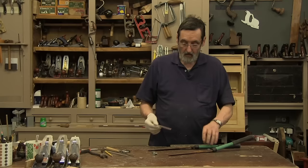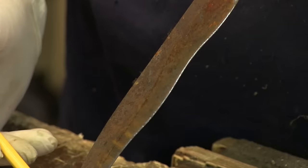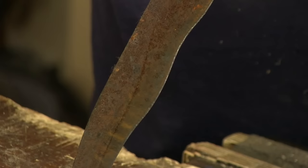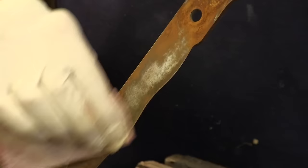You don't need very much to remove the rust — just some 250-grit sandpaper; any kind of abrasive paper will work. Can you see this white line along here? This is from when I opened up the shears and closed them again — it took off that surface of rust. So I don't want to touch that with the sandpaper. I'm going in here and taking this back down. This is slightly hollow ground in here, and I'm avoiding this white edge — not going into it, staying inside of it.